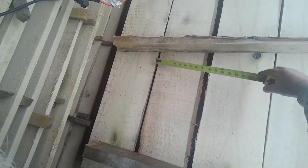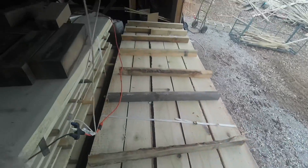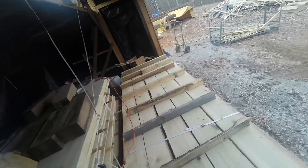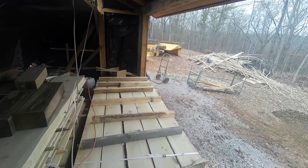I use a plastic baffle so the wood doesn't see any of the sunlight, and I have fans blowing the heat on top of it down through here. My third fan is blowing off of our heat exchanger right here. I'm just going to check these top boards — nine-and-a-half. The bark side — I can't tell — nine-and-a-half, nine-and-a-half. I would never cut nine-and-a-half and put it in here; all my numbers would have been nominal — 10, 11, 12. So this is all ready to go. We're going to cut it down on our mill saw, straighten out any pieces that need it, cut to size, plane it, put in our lap joints, then stain it.